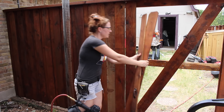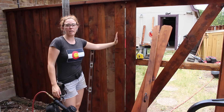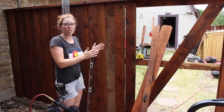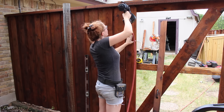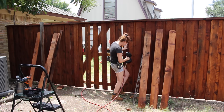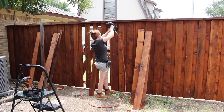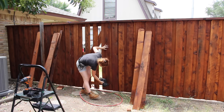A small hiccup — just a lesson learned since this is the first time doing a fence. When building this section out, it would have been much smarter to start here and work our way that direction. Instead we built up to this point and then tried to fill it in, and it's just not lining up. To fix it, I ended up fudging the placement of the pickets and breaking from the standard spacing. I fudged a few pickets on the left, used normal spacing across the span of the gate, and fudged slightly on the right. But after everything was said and done, I think it's one of those things that if you're not really looking for it, you don't notice it, and I'm pretty happy with how it turned out.